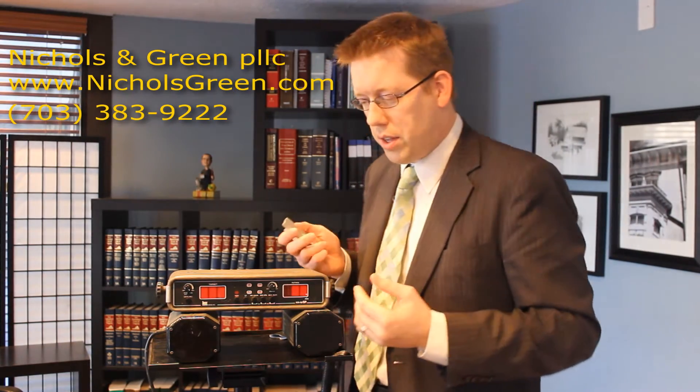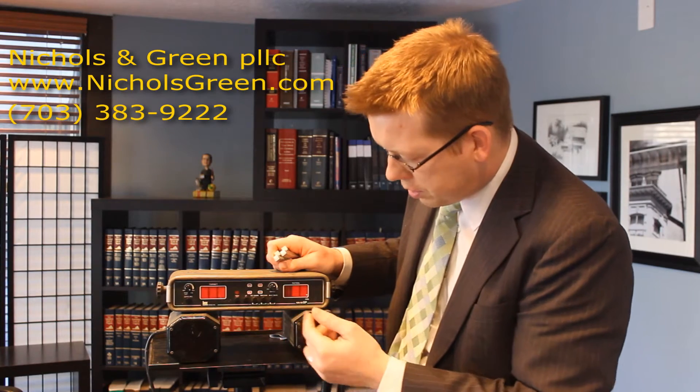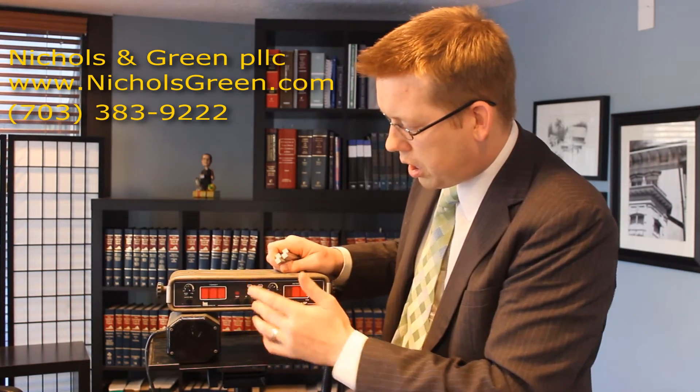Moving mode means this radar will work even if the police cruiser is moving. You can pull over on the side of the road and point your cruiser towards oncoming traffic to catch speeders, or drive around in traffic and catch speeders as they drive towards you, away from you, or even coming up from behind. This device has very few features: a range knob, a volume knob, and squelching. The Doppler audio — that horrible noise that sounds like the most obnoxious sound in the world — is the audio interpretation of the radar signal coming back. As moving objects go through the radar beam, the pitch and tone of that sound changes, and it's one of the tools officers use to identify speeders.